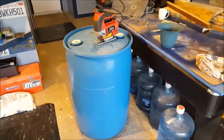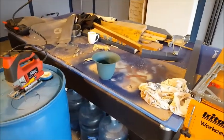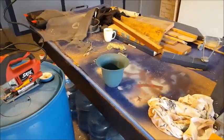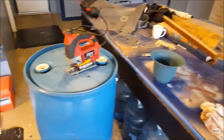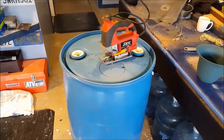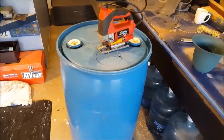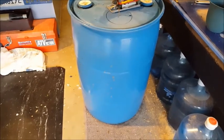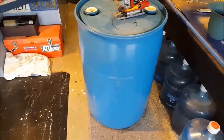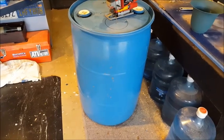You can find them online or wherever you need. I just bought a plastic plant holder that I drilled some holes in the bottom and put some screen over to keep bugs and stuff out. That'll go in the hole that I'm cutting out right now, where the downspout is going to drain into. Then I'll put an overflow somewhere at the top and a half-inch spigot at the bottom.